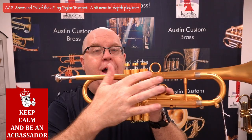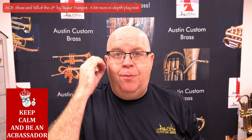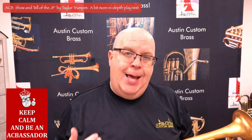The Taylor leadpipe is supplied for all these horns. This leadpipe is a twin tube pipe, meaning there's a sleeve over a sleeve. You can actually see the seam connecting to the top ferrule here. What that does is it really contains the resonance and keeps the horn very centered. Conn did this back in the late '30s or mid-'30s with their Vocabell models — they had a sleeved leadpipe — and other companies like the Selmer TT had that as well.